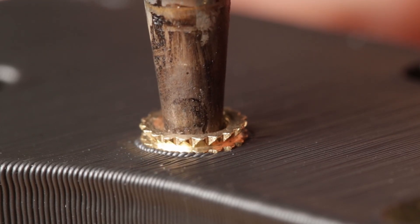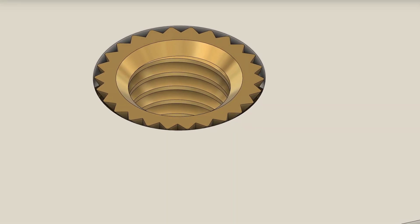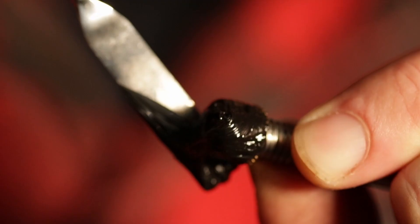But this got me thinking — what if we're going to add those inserts using that ABS glue? Normally you just press them in with a soldering iron. It's difficult to position them correctly and upright, but if you design the holes at the outer diameter of those inserts and use this ABS glue, I think you can place them way more accurately. And maybe it will even be stronger, because that ABS glue might just bond better to the brass itself. There's only one way to find out.